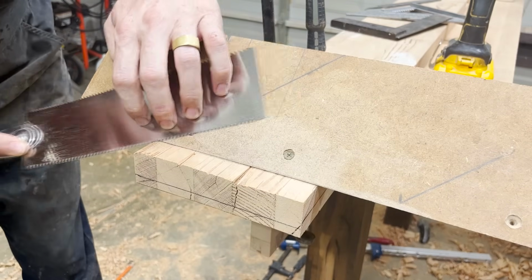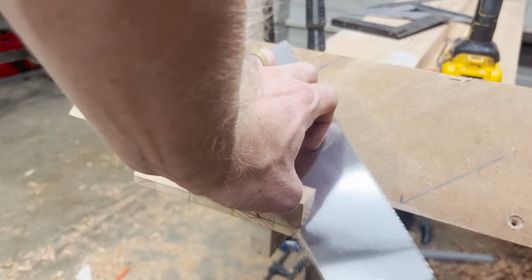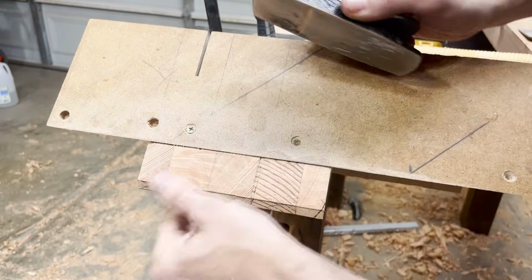I thought the weld board would look a lot better if I added this 45 degree chamfer on the edges. To do this, I screwed in a board that was cut at a 45 on the underside of the weld board. You won't be able to see those screw holes on the other side when it's flipped over.